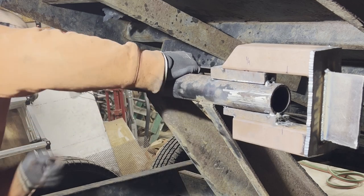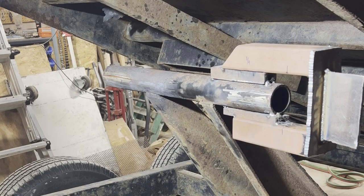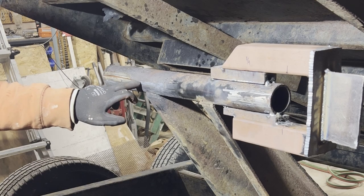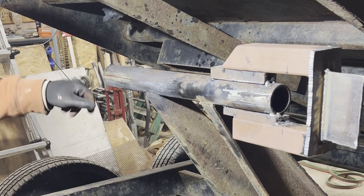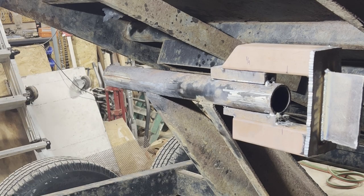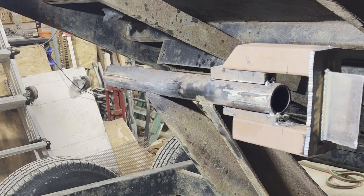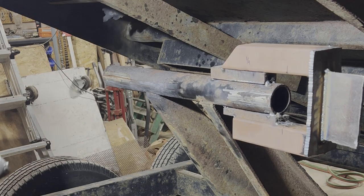Well, I'm not even through. Perfect. Go through, clean everything up, blow it out. I'll run some carbon steel TIG, ER70S2 probably. Run a weld up in on that edge. Gauge, make sure the inside's full, but I think these are going off to the machine shop.